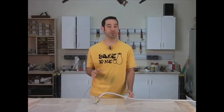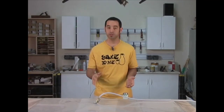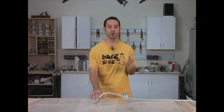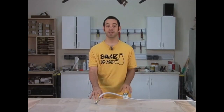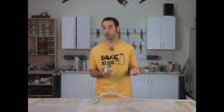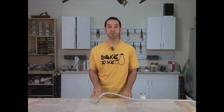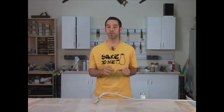It still works, but I've got to leave my pump on constantly or else it won't hold the proper pressure. Having made my own vinyl bag in the past using Joe's instructions, I was pretty confident going into this project. But the fact of the matter is this polyurethane material acts quite differently than vinyl. Instead of working like contact cement, this adhesive partially absorbs into the poly and causes it to curl. So by the time I was at the end of my run, my pieces were curling like potato chips and the glue was nearly dry. The key with this material is to get your pieces together while the glue is still wet — I found this to be pretty darn tricky, and to be completely honest, I don't think it's worth the hassle.